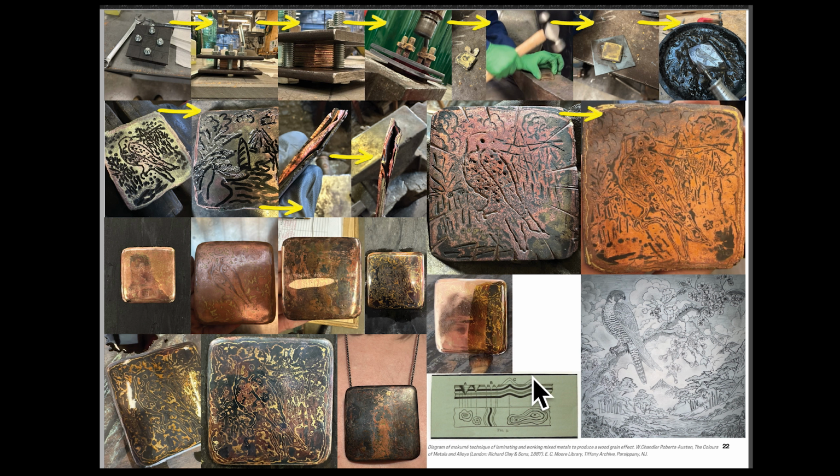and I also did the reverse of this, which is I punched down, which pushed the layers down in this sort of pattern, and then when you file away, it just leaves this sort of pattern. So I punched the trees and the mountain and the clouds seen here, and I also filed away down like this. I filed away at the edges, and then I also used the carbide tip to drill out the pattern of the falcon. So what I did was fuse the stack.